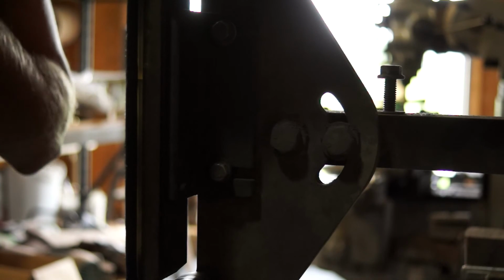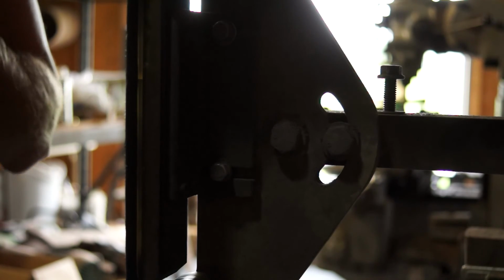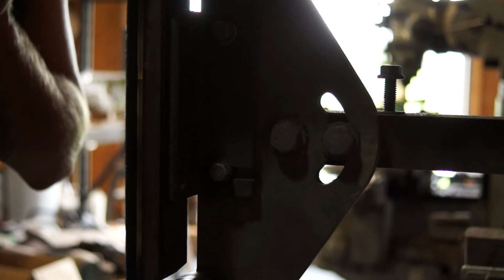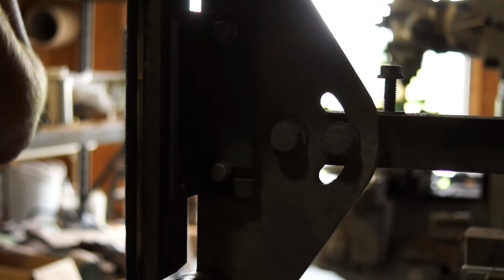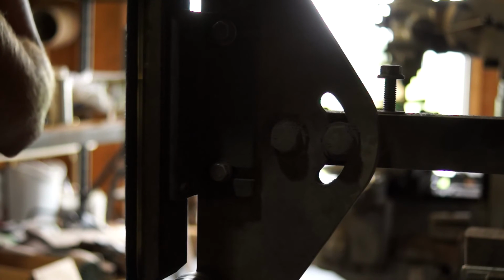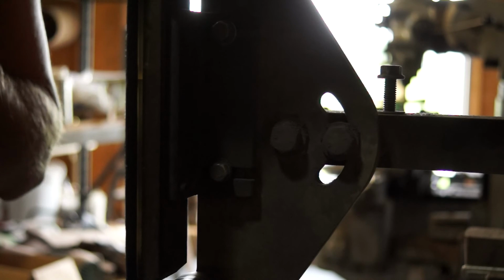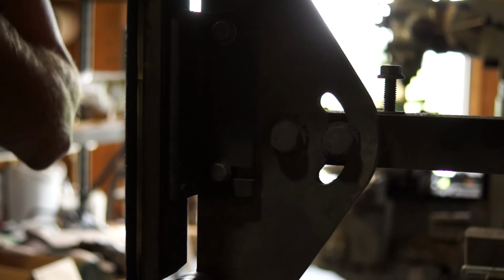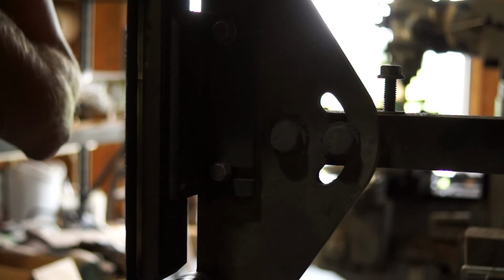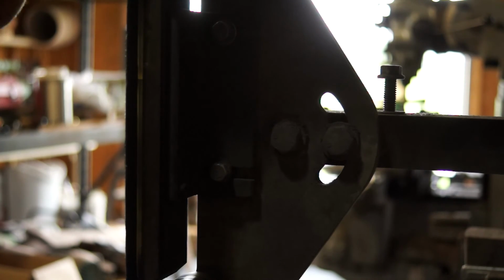You still have to make sure you have very hot or very sharp belts, or else you overheat stuff. I'm a big fan of using fresh belts, because if you've got to press too hard to make that belt last a little bit longer, what have you saved? You overheat a blade, ruin it. Well, the cost of a belt is $7-8 each for good ones. So you do the math there real quick. Screwing up one knife, you can pay for a lot of belts with one knife. So let's get going.